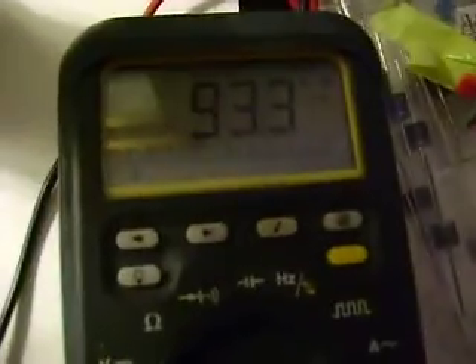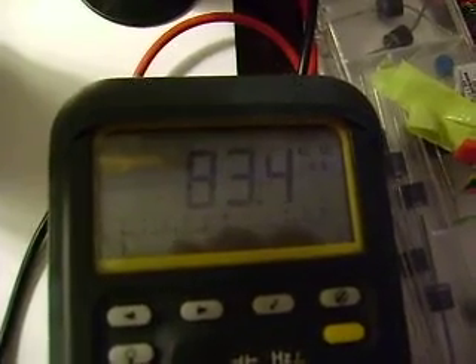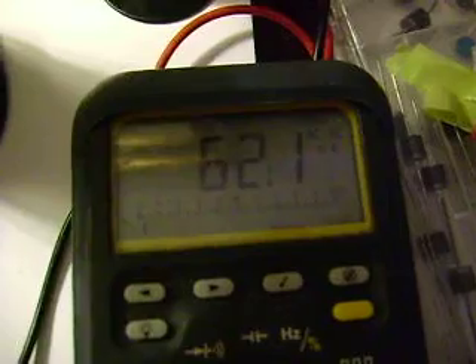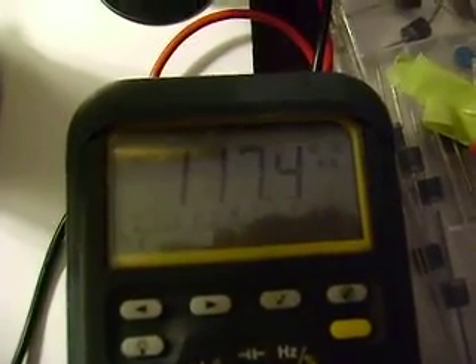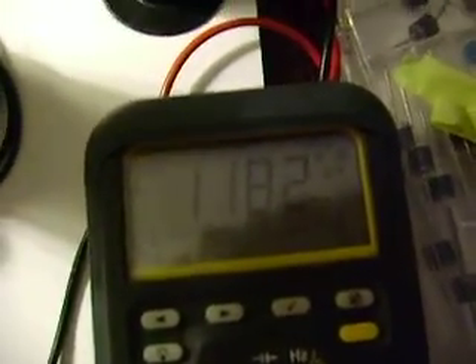111 milliamps. Down here... 83 — let's say 82 milliamps. And then we'll go direct — I'm just going to put it right on there. 83... I'm probably getting 122 without that little inductor. So it might be just acting like a resistor, but it could be helping some.